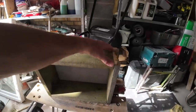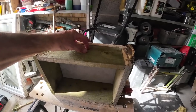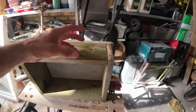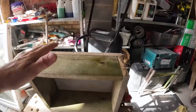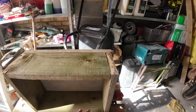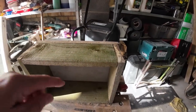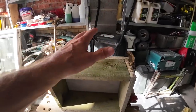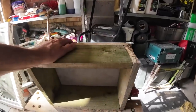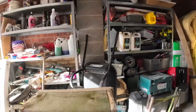We're going to have a plate this big. That's probably two holes in it. And then the 100 by 100 post is going to sit at this end and go up the wall. So this is just to spread the weight of the post down onto the foundation of the house. We're not digging down, putting a concrete pad in because we don't need to because the wall's below. Because we're removing the wall in the house, this is going to be all wall and it's coming out. So this post is going to take the weight of the steel, which is going to go above the top.